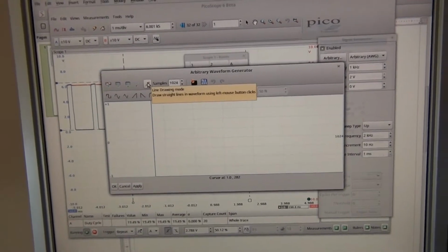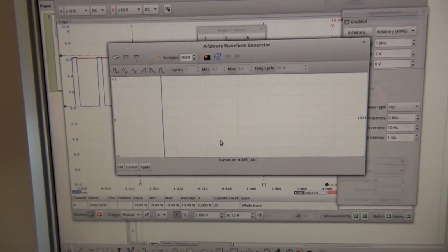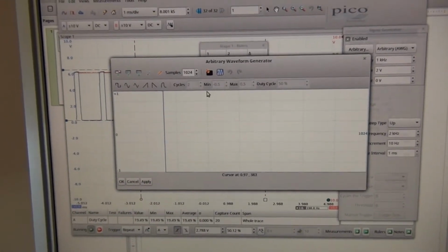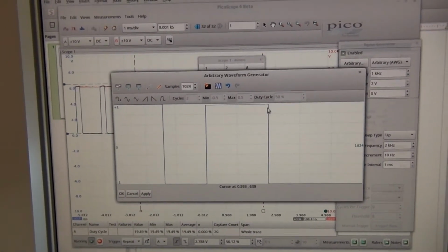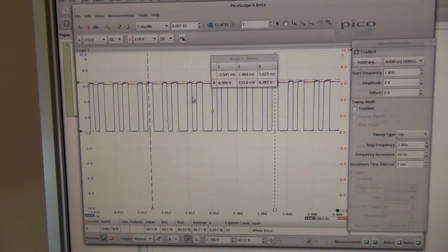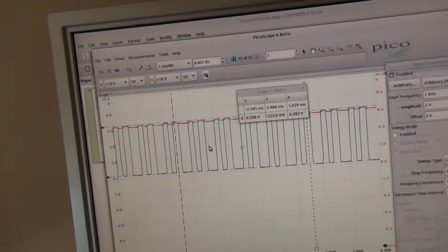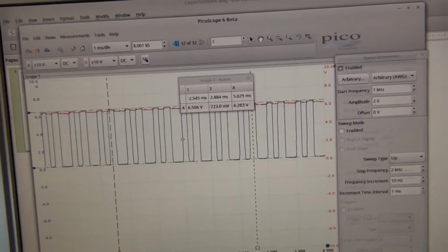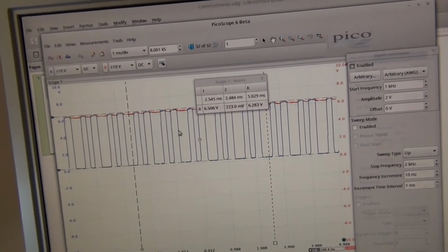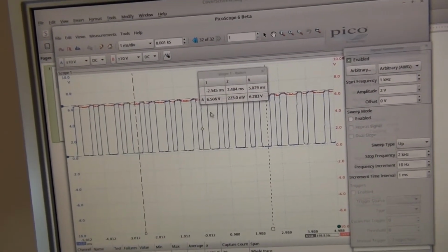waveforms that, for example, correspond to the camshaft signals. So you can have a fat window signal. Let's try this one. Okay, the trigger is not happy about the different sizes, but let's stop it and see that it's actually a smaller signal and then a larger pulse time-wise, and then it repeats itself.